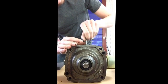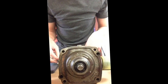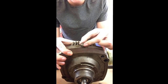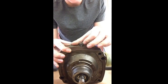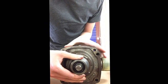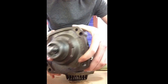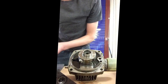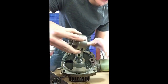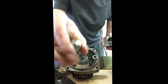This would be a stick thing that screws into something on the inside — looks like that. Another thing that's eleven sixteenths is the part that holds on the dump valve assembly, so you just loosen this by turning it to the left. Now we're going to pop this rear housing off. I'll tilt it up a little bit and pull this right out. Inside here there's going to be what's called a ball piston motor, and it has five of these balls — hopefully they drop out and look like that.